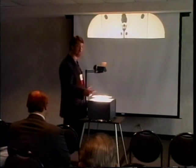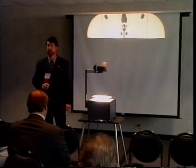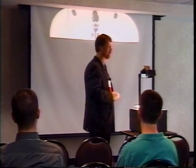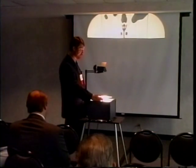If you have too small of a roller jewel, what can happen to the watch? Yeah, you have low amplitude. You lose too much of your strength by the time the fork slot strikes the roller jewel. Okay? So our roller jewel fits in the fork slot.